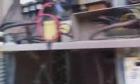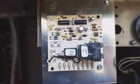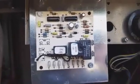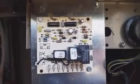We're gonna grab some power from up here and disconnect the old defrost thermostat so that there'll be no confusion. I'm not gonna rip out every single control that has to do with defrost because it's a lot of time you don't need to spend on it. If it's not initiating a defrost from here on out, we can run this control in parallel — it will function. The other ones will just be dormant for the rest of the life of the unit, which probably isn't all that long.